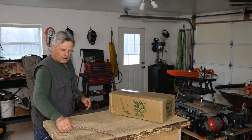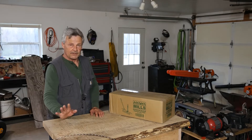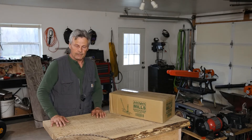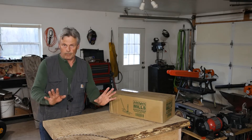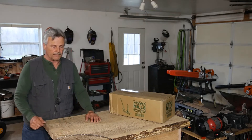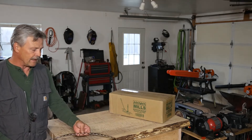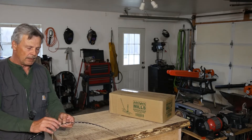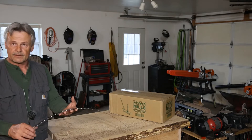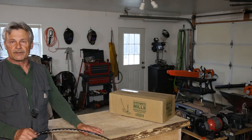Well hello everyone. I've been enjoying the sawmill and now it's time to start sharpening a couple of blades. I went ahead and ordered the tooth setter from Woodland Mills. This will cover all of the blades that they offer, and I bought this box of blades when I purchased my sawmill. What this device will do for us is put our blade back in set, so we will be getting optimal performance when we're sawing through material, and it will actually make sawing smoother.